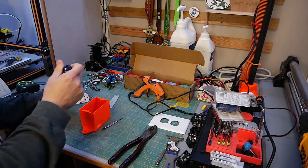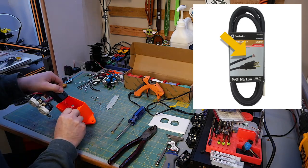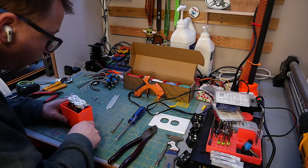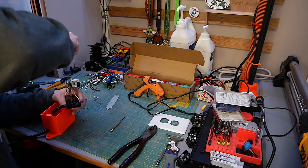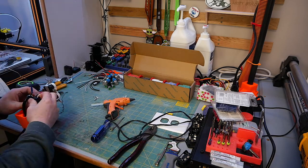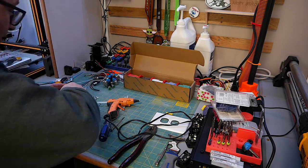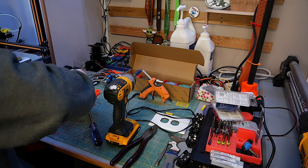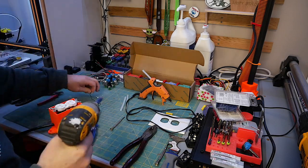To start the fresh new build, I got an appliance extension cord — a regular extension cord with one end having bare wires and the other end having the plug. I got a 20-amp extension cord made from stranded wire, which really made the installation a lot easier. I used some spade connectors on the end of the extension cord and attached it to the wireless plug, put a little hot glue down in the bottom, pushed the plug down and held it in place until it was secure. Then I attached the ground wire for the receptacle. At this point I realized the receptacle was turned around backwards, so I had to pull the entire thing out, rotate it around, and screw it into place — no big deal.